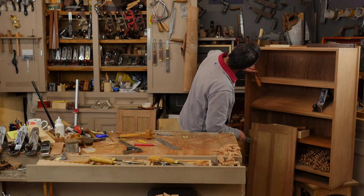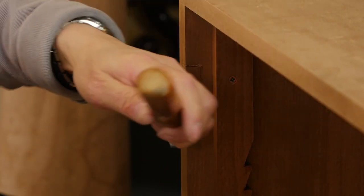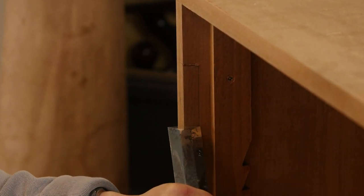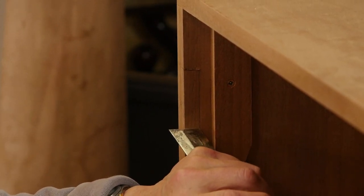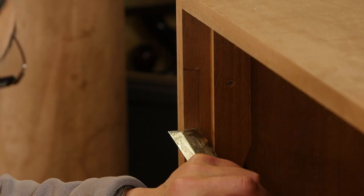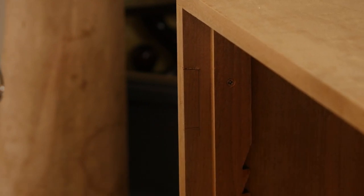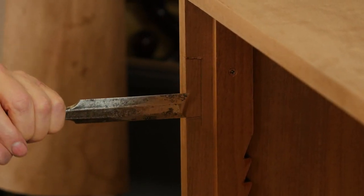Back into my knife wall again. Nobody's really going to see inside here so I can't get into this knife wall easily — I'm going to put a heavier knife wall about three to four millimeters above the other one, and then I'm going to chisel into it sideways.